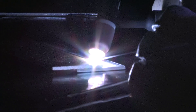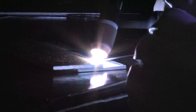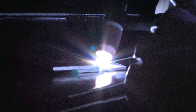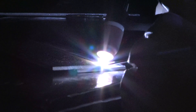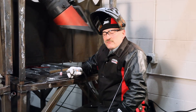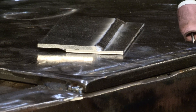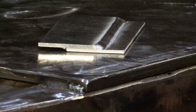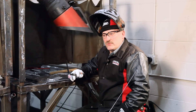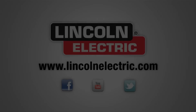I'm going to start backing off my current now — it's getting pretty hot. Making an adjustment here, current down. There's nowhere for the heat to go at the very end. I'll back off, freeze the part a little bit, add a little extra filler metal on top. Very important at the end to fill that crater up — a concave crater causes cracks in some alloys of aluminum. So I backed off that foot pedal, added a little filler metal on the end, and filled that crater up so it's convex instead of concave.